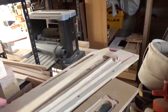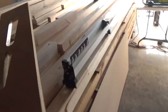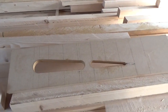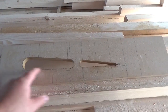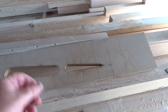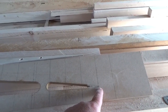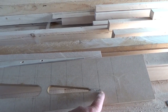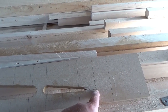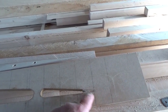Under here is the trailing edge routing jig. What I've found is that the diameter there is actually quite tight — I don't have a router small enough for that. So what I've concluded I'll do is use that as a routing hole, put a screw in there to mark the ply, then drill a hole in the ply and just cut that last piece out.